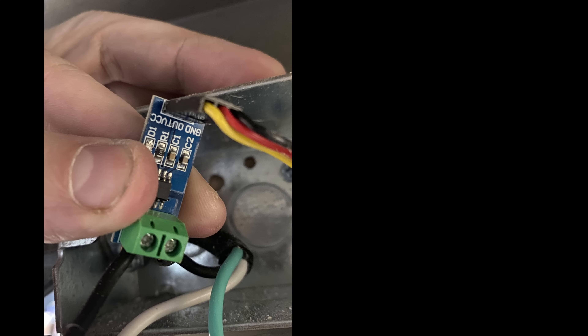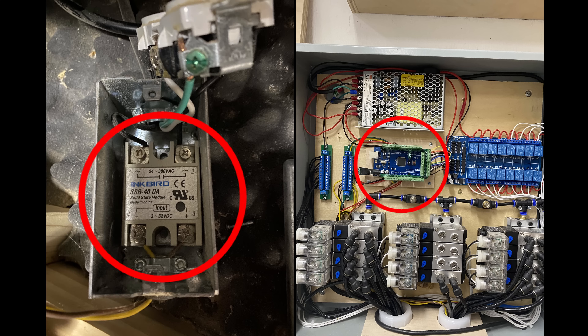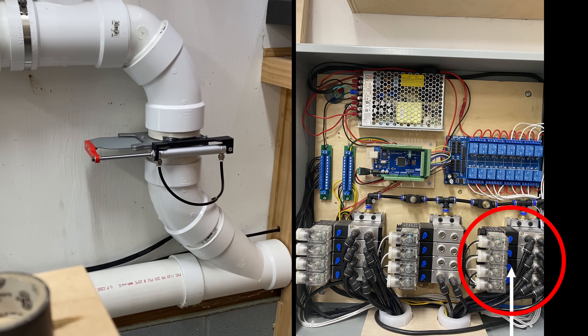Then, when we are done, we turn off the tool. The current sensor detects a change and sends it back to the Arduino. After three seconds, it then powers down the dust collector. After waiting 10 seconds to allow the dust collector to fully stop spinning, the relays then switch back and cut power to the solenoid valve. The solenoid valve then redirects the air to the other side of the pneumatic cylinder, forcing the blast gates to close. This delay is there to prevent damage to the motor and, if you're using thinner piping for your system, could cause it to collapse on itself.